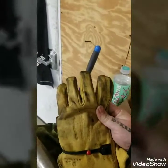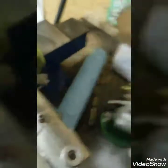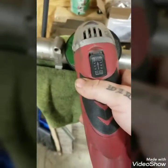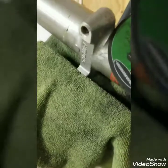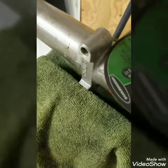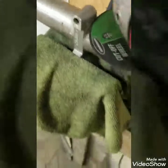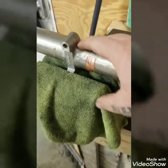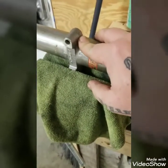I always wear gloves because when you don't, you get gnarly scars - that's from sinking one of these blades down to the bone. Pretty much all I'm going to do is take my grinder and go as low as I can - about here. You want to take off as much material as you can with the cutoff wheel without cutting the tube - the more you take off, the less you'll have to take off later.